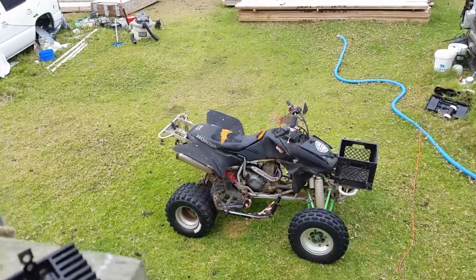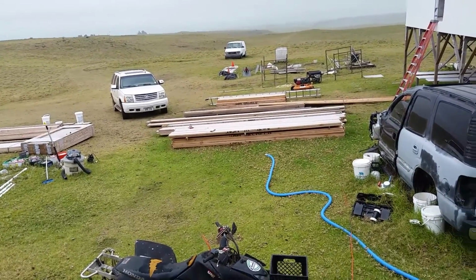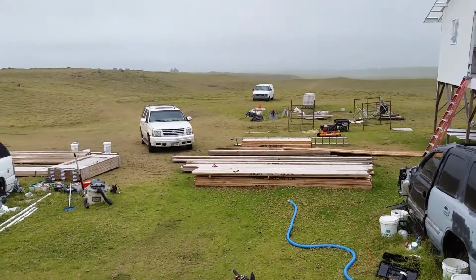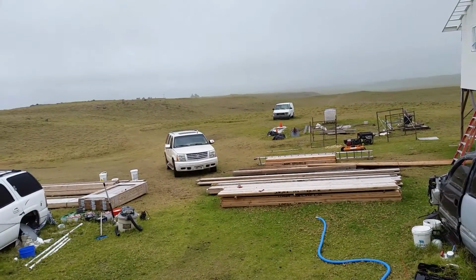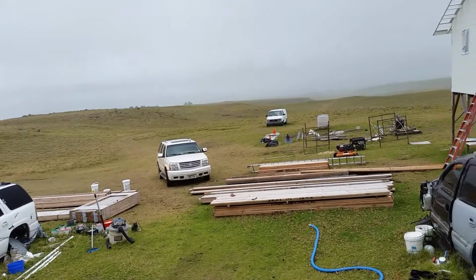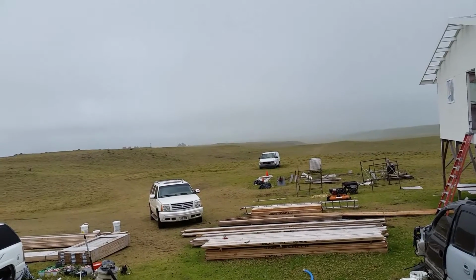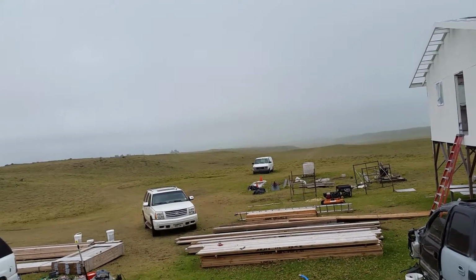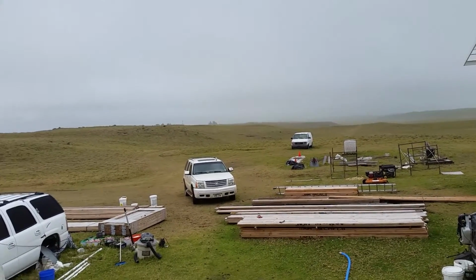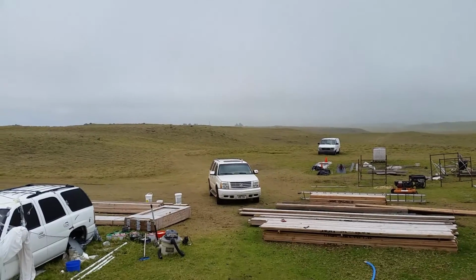All right, guys. So I went down to my brother's house and gave him one of my extra bridge rectifiers. We stopped the wind turbine so it wasn't spinning and made all our connections. Once we faced the wind turbine back into the wind, it took not even 2 minutes, and a wind gust came by and it started up again and producing power. So he's back up and running as far as his PMA, his wind turbine, is concerned.